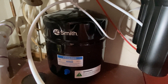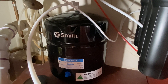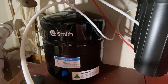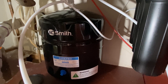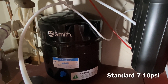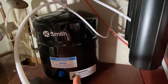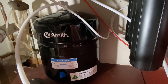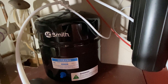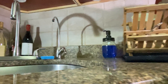However, it doesn't hold five gallons of water. That's because inside the tank there's a rubber bladder that's pressurized from the factory. Some tanks are 10 pounds, 8 pounds, depending on what the factory suggests. The more pressure inside the tank, the higher pressure that comes out of the faucet. The least amount of pressure, the more water it will hold, but the slower it will come out from the faucet.